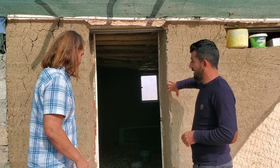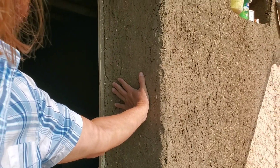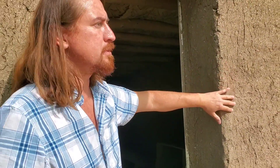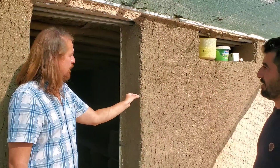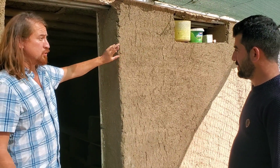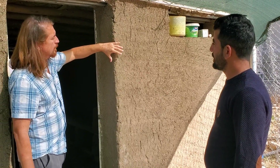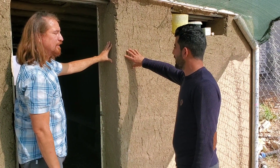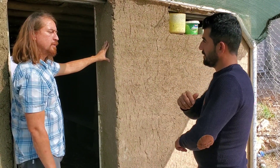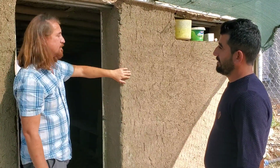So the thickness of these walls — it's about this thick, maybe the size of my hand. And how many coats of earthen plaster are you putting on top of the bricks? Two coats, maybe one — about that thick each. So there's an earthen cob plaster done twice to make the final finish. It's standard earthen construction. And for the finish plaster, rather than white lime plaster, they use a little bit of goat hair mixed in to make a very fine plaster. I just learned something — that was awesome.